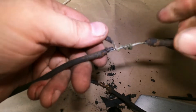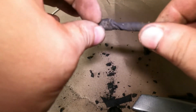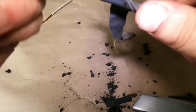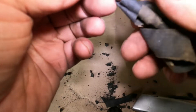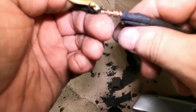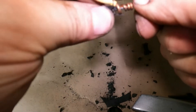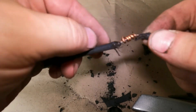Now this is all on one wire that I had. And this connection with cloth tape — it's obvious this is inappropriate. That's a piece of Romex wire that was put on there. Again, there's no proper way to connect Romex to knob-and-tube.